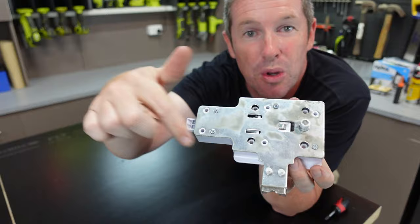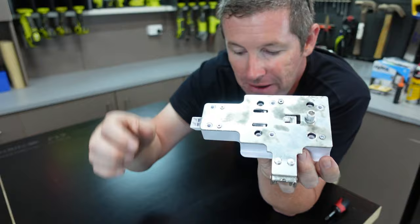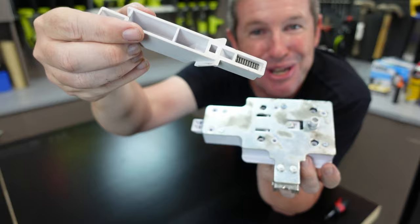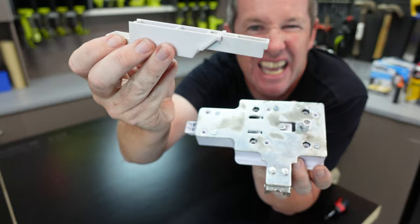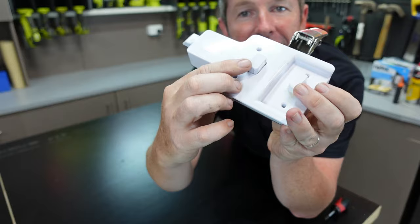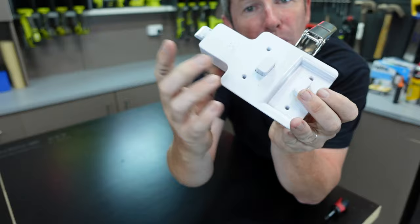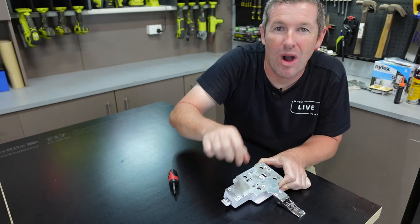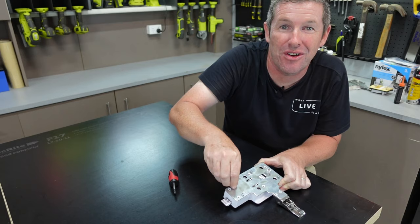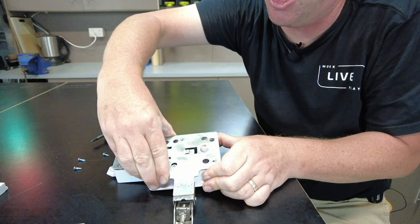To service this latching mechanism, you need to remove this metal backing plate off the unit — it's fixed by four Phillips head screws. Simply release these and remove the backing plate. Be very careful because the latch has a spring in it which will probably pop out. Just expect this spring to pop out of the snib itself — it's pretty easy to put back together so you don't need to stress. Also take note of how this push button goes into the back of the unit, because it has a little wedge on it that pushes this snib in and out of the mechanism itself. Wind the screws out with a number two Phillips head screwdriver and very carefully lift off this backing plate, noting that the spring is inside the snib.